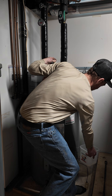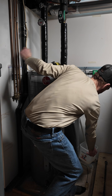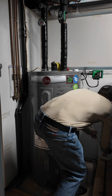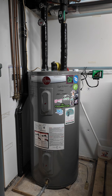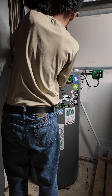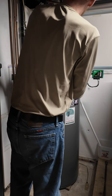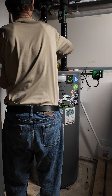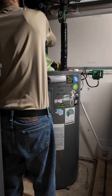We always want to make sure that you purge the relief valve — there's a little bit of air in the relief, and you don't want air in your relief valve. You want that relief valve to be seeing all water. Now we just have to dry out the top of the tank from that tap above — had a bit of a drip from the tap, but that's normal. Sometimes you end up having to change the guts on that tap.